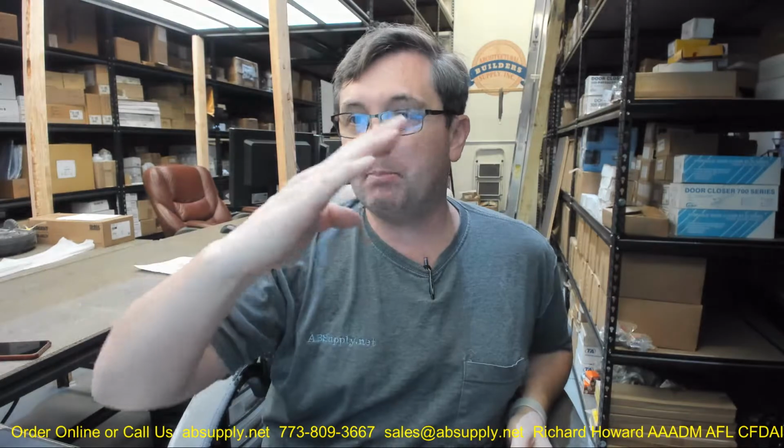You don't cut the zip tie until you're ready to go live. What I mean is you're going to remove the old one, and replace and fully bolt the new one. The lid should be at about a 35-degree orientation. I'd keep it about there where you're working on it. I'd have somebody control the top of the lid pretty soundly, and then I would carefully pull that pin out. I would quickly remove it.